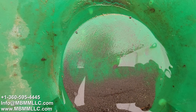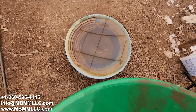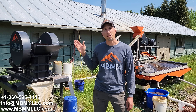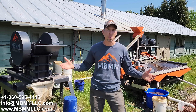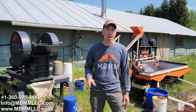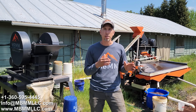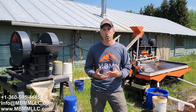I'm going to combine everything in the pan and everything I panned out. We'll put it all in a bag and send it back to the customer. We got our samples all bagged up and we're going to send those back. You can see the value of the jaw crusher, hammer mill, and shaker table. A lot of people will buy these three pieces of equipment — they're down in gold country with mines, tailings, and dump piles all around them. They set it up at their shop, go out and start testing different ore piles and different bodies. They can run it through the equipment really quick and easy and run a couple tons to see what kind of values they can recover.